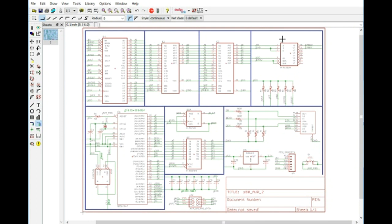So I think it uses a single NAND 7400 chip in order to do the address decoding and also the interrupt and the wait states. So we're doing it a little bit differently here, but it's functionally about the same. And I think this actually gives us a good basis for being able to build a computer. So yeah, I kind of like this. It looks like it's probably going to work pretty nicely.